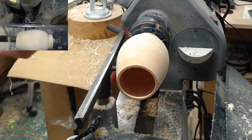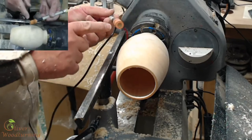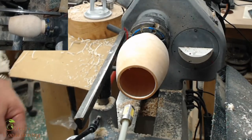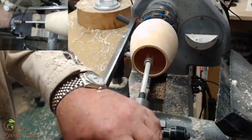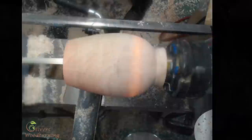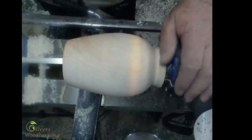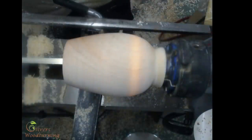Then we're going to bring in our light. This is a little LED light. Got a bung on the end and it fits into the quill. We can then bring this up. We're doing technical adjustments with the camera. Bring this up and turn the light on. And we can see there, we're a little bit thinner there. And you can just see the light. Now you should be able to pick that up on the screen.